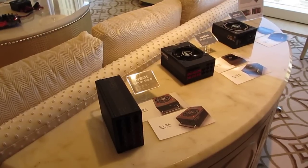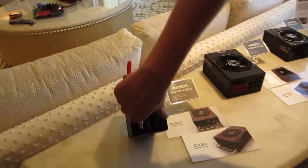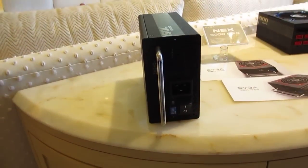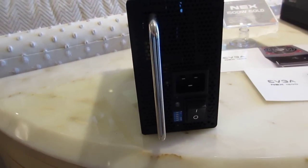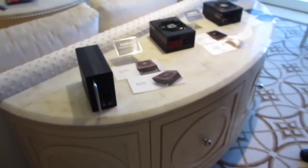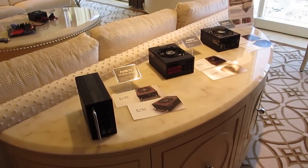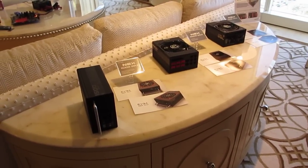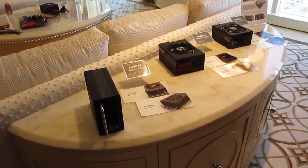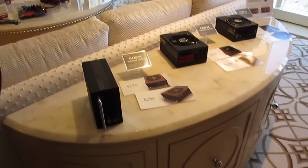There's a lot of new stuff and we're really excited about it. If you look on the back there are some switches that allow you to manipulate the power supply. There are features we're not discussing today, but you'll be able to do things like enable OC mode. You can also make it run in what we call dummy mode, which means when power is connected it just runs — useful for people running multiple power supplies, so you don't have to jumper anything.